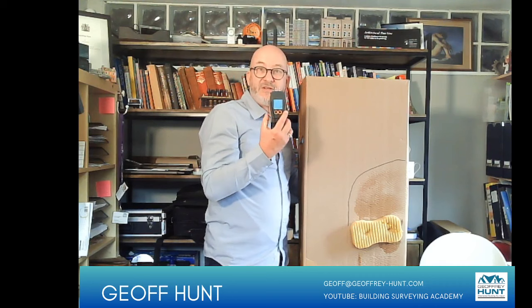So let's go over to my demonstration wall here. One of the first important things to do is to take your initial datum reading. Go somewhere where you know it's going to be dry on the house — maybe on the first floor, really inside the house — and with a bit of timber like a piece of skirting board or door frame, just check out whether there's a big problem in the house, because there are lots of other reasons why this could go off.